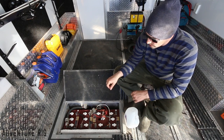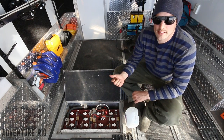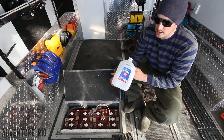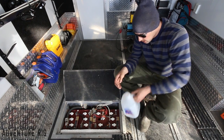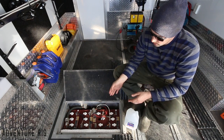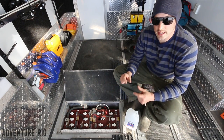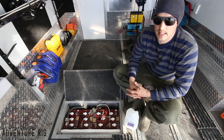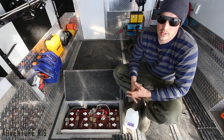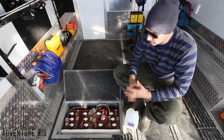On the Plus models, inside, I actually have a max level that I can fill it to, and what I'm filling it with is just distilled water. Now, if you guys were to pop your caps off and see the plates inside and be able to see that there's not any kind of acid or water on them, you definitely want to at least get the plates covered with acid or water.